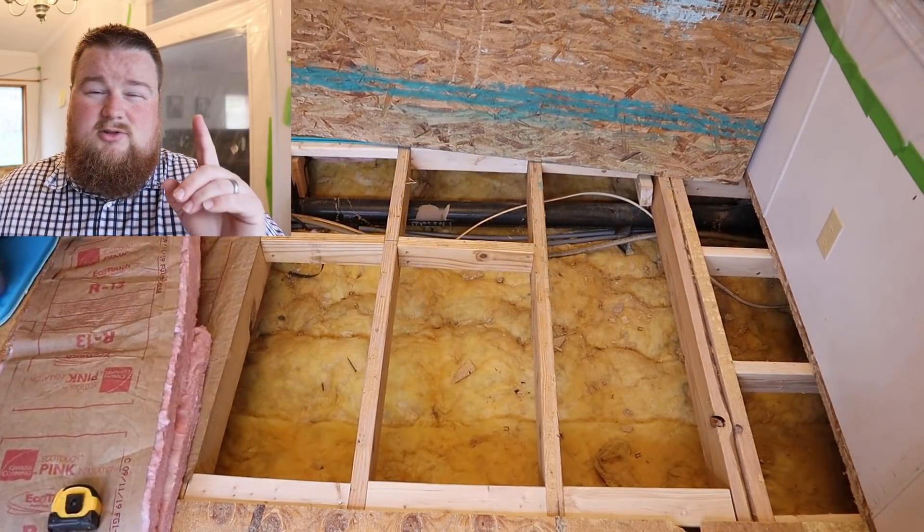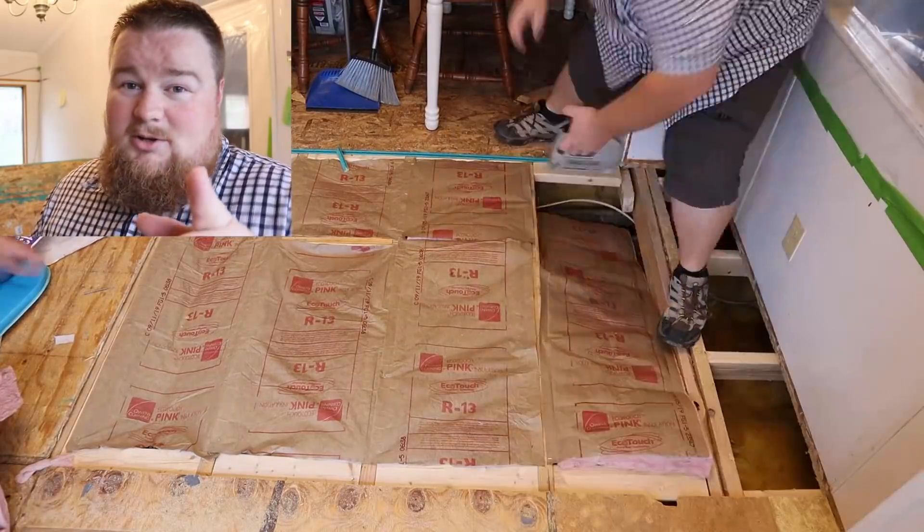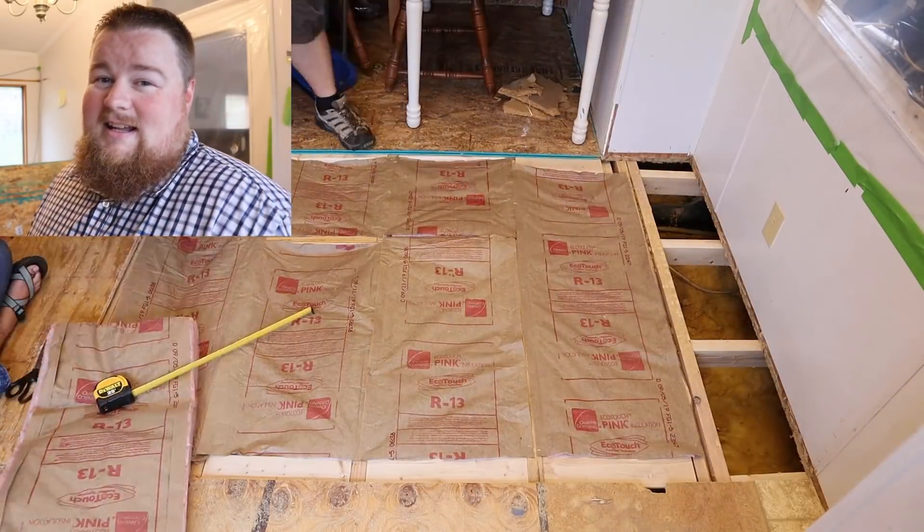We had a couple of comments on our last video about insulating and not including our water lines with the insulation. We live in the southern part of the US and we don't have extremely cold winters. In addition, we have an insulated crawl space. Our underpinning of the house is two-and-a-half-inch thick closed cell foam sandwiched between fiberglass panels. We've already done our bathroom with the same insulating steps and haven't had any problems with freezing. That being said, just because we're doing it this way, don't assume you can do the same on your place if you're doing a renovation. Do what you're comfortable with, because it'll be you doing or paying for the water line repairs.